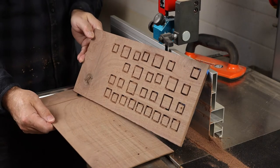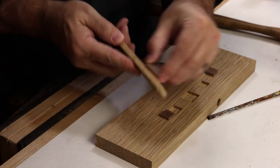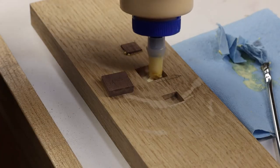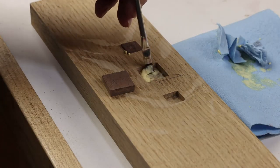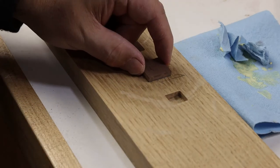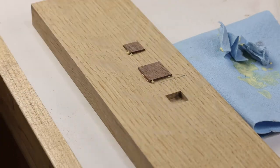Touch the back edges of the squares with a little sandpaper and this will just help to ease the fit. When you're installing these inlays there's really no way to test fit it — you just have to trust that the router has cut everything to exactly the right size. As long as your corners are squared up with that chisel, just add your glue and you'll feel it as it goes in place that it's going to be a good fit, and just gently tap it home.